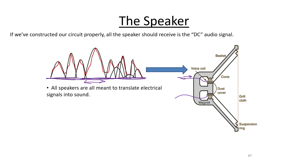The wire in these voice coils is incredibly fine. If you take apart a small speaker and find the voice coil — sometimes a little difficult because it's typically wedged in with all sorts of other things and glued in place — the wire is well-nigh the thickness of a human hair. And yet it functions the same as any other coil of wire: send a current through there and you create a magnetic field. This solid piece here — and I'll change colors — is a permanent magnet.